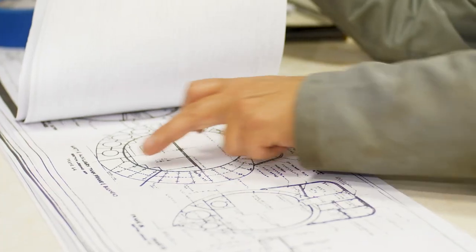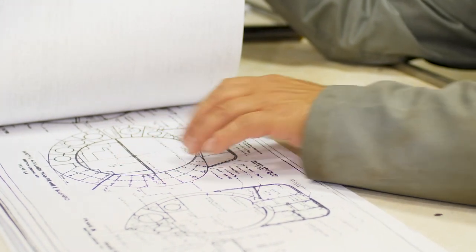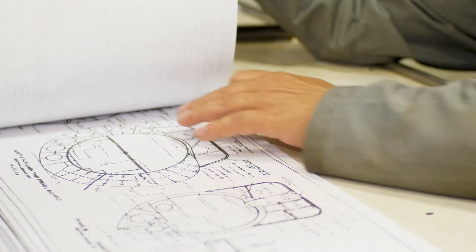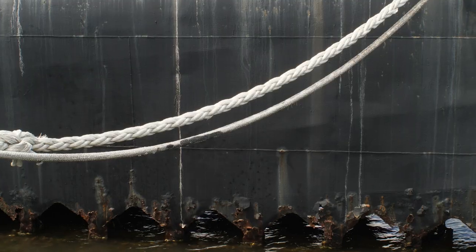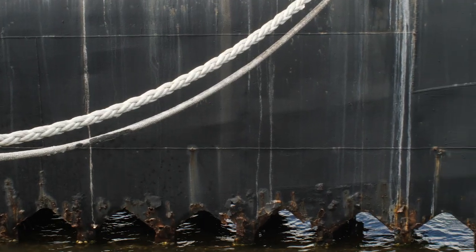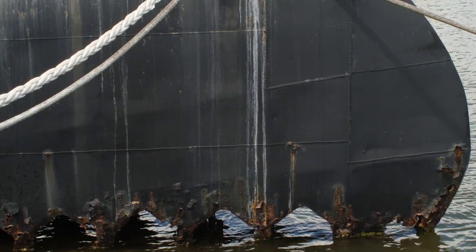A submarine is essentially a tube within a tube. The inside tube that we're standing on is always dry, and the water's always on the outside. But the outer tube is what you flood to go down, and then you blow air into it, which squeezes the water out of the bottom and makes it go back up. That's how submarines work. But this boat is afloat because of its exterior ballast tanks, which are in tough shape, which is the only reason we're doing this whole process. If the submarine was in fine shape, we wouldn't have to be going down this road.